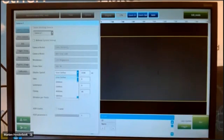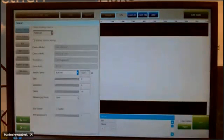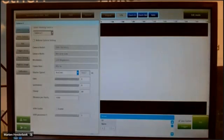You have to set up your shutter speed. Normally, I start roughly in the neighborhood of 60 milliseconds. And then you see directly what's happening below my camera. If I now go under the camera with my hand, you don't see anything changing. That has to do with this button. Now I'm in live update, and then you see my fingers, my hand, what's happening there. You can also use the trigger button in this case. And you can switch over to run mode.